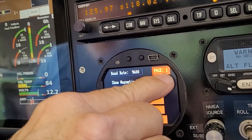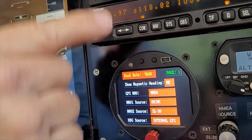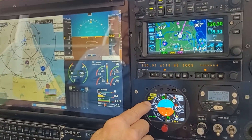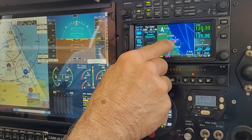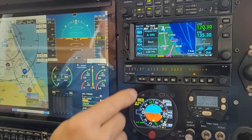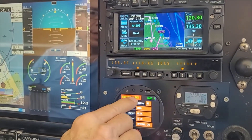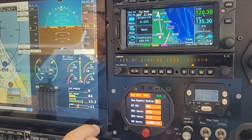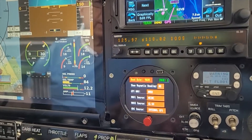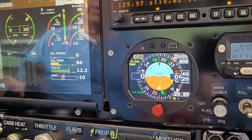We are on page one. Here we have baud rate, which has to synchronize with your radio. If the baud rate is correct, you should get information about the go-to waypoint — in our case Daytona, KDAB — and it should appear here along with the number of miles. When you change the baud rate, you should turn the unit off and on. Change the number by rotating the knob to 9600, press the button, and then restart the unit for the baud rate to take effect.